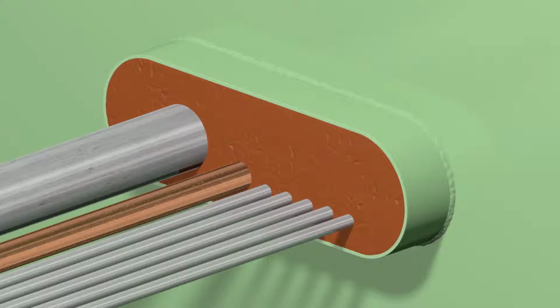A last check should be made to ensure that the sealant layer is pressed down tightly and that no larger open holes are visible. Air enclosure in the sealant layer should be avoided during finishing because this would have a negative impact on the performance of the sealant layer under fire exposure.